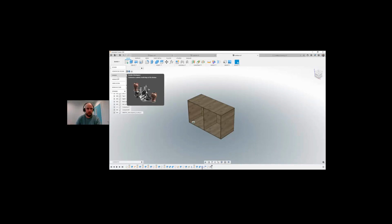We have a rendering environment here in Fusion 360 with an animation, which means you can have everything animated and how it goes together. So if you wanted to do an exploded view and drop the bottom piece, then drop in four dowels, then the left, then the right, then the top, we could do a little animation movie inside here as well. We've got simulation from all the different tests: stress testing, buckling testing, thermal testing, flow testing. There's a huge amount of simulation inside here, with generative design. The main focus today was on the design and manufacturing.